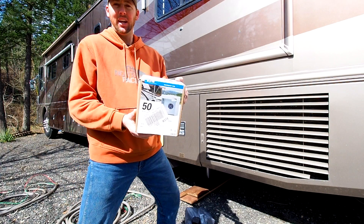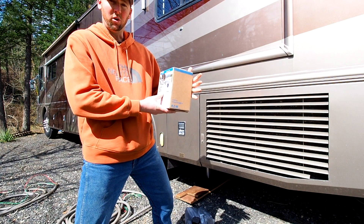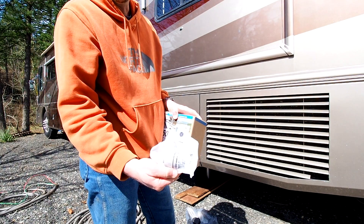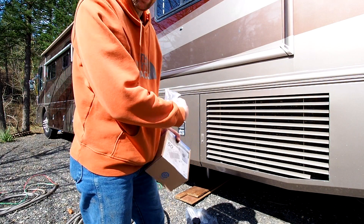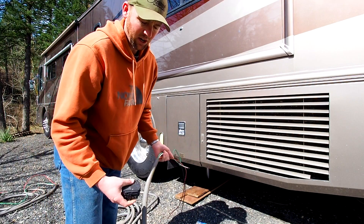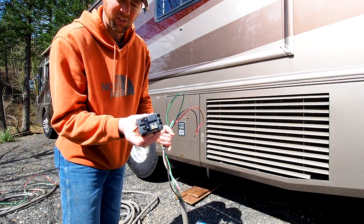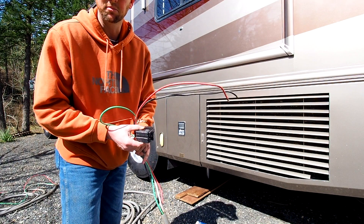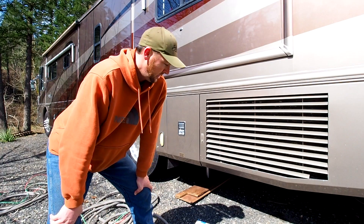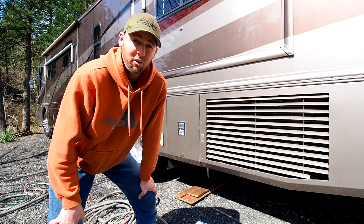So we picked up a 50-amp receptacle — we're going to mount this outside of our garage on the wall. Coming out of the 50-amp receptacle, I'm going to have this liquid-tight connection going to that cable, and then this cable inside the garage will go up to the breaker, and I'll put this 50-amp breaker into our main power panel. Definitely hire a professional electrician if you don't know how to do it, but it's not very difficult if you learn the basics, and I'm going to show you how I do it.